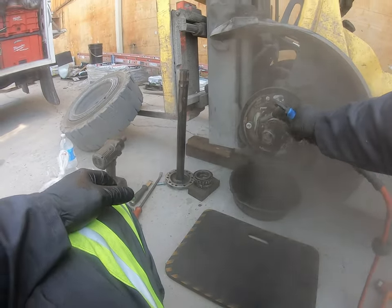We're going to clean this off and clean up the brake drum. We might sand it down a little bit to get rid of any imperfections. We're going to replace this seal here, the seal here, and the seal inside - down in there. We'll replace these two seals and the master cylinder, bleed the brakes, take apart the other side, do the same thing, and that's pretty much it for this one.